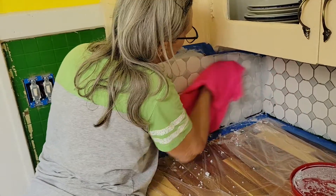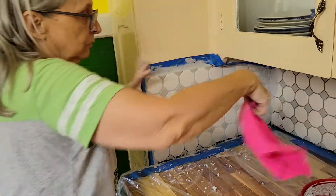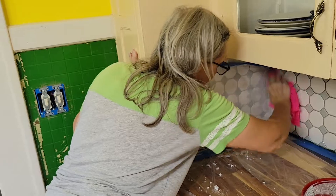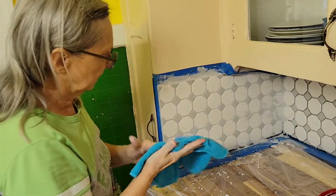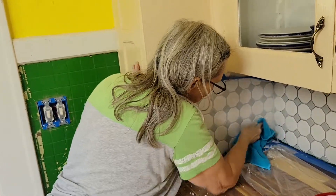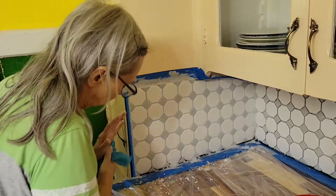I get the microfiber — the instructions on the grout said to use microfiber. I've done tile a couple of times in a couple of houses, and I've always used sponges, but I really like using the microfiber because I can wipe and then kind of turn it and get a totally clean spot, which keeps me going a little bit longer with a clean cloth. That's super important to have a good outcome so you don't end up with grout residue on your stuff.